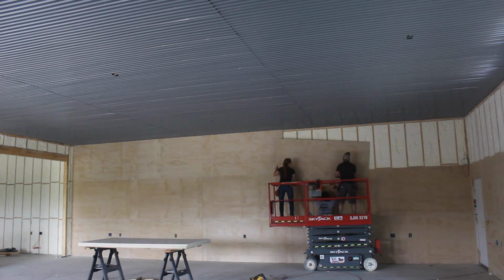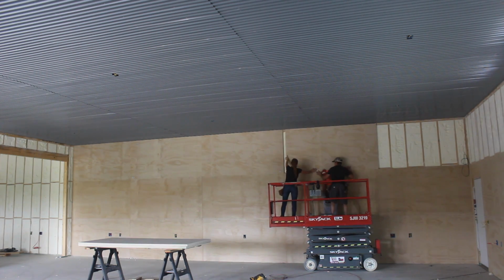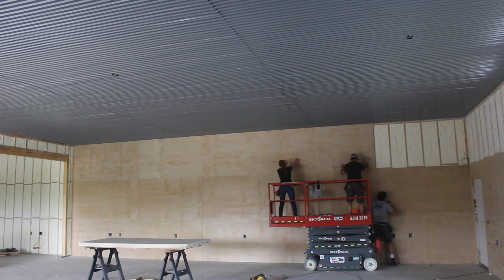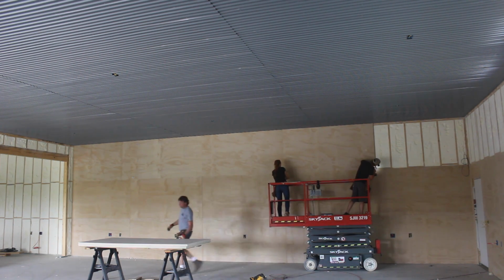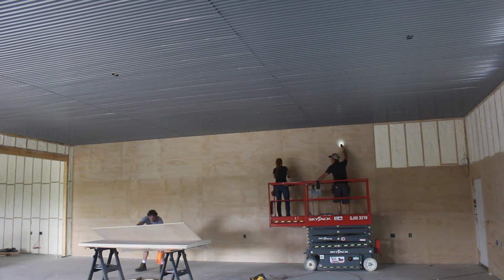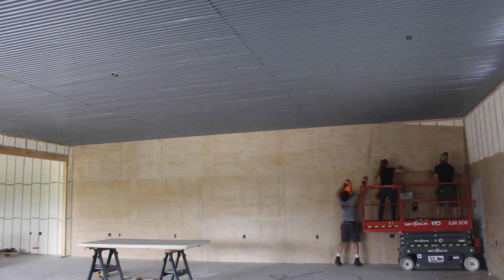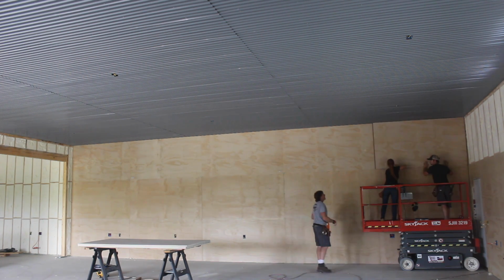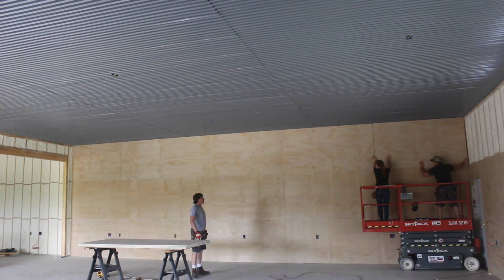Doing the plywood is a big step. However, I was really surprised at just how quick and easy it went. Brian used one of those sheet handling handles to make carrying a full sheet by himself easier, which means that as Cody and I were securing the current sheet, he could be grabbing the next one. And also, having the previous row laid down and therefore acting as a shelf was a huge benefit. Then also throw in that almost none of these top sheets needed any cutting.